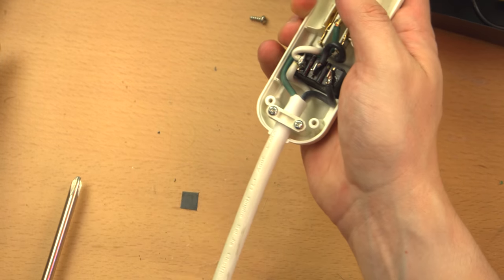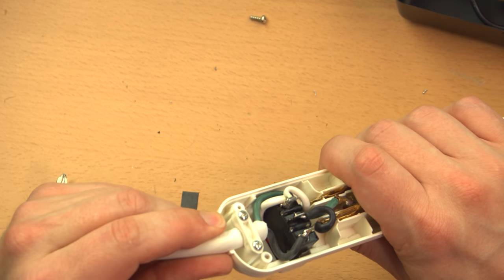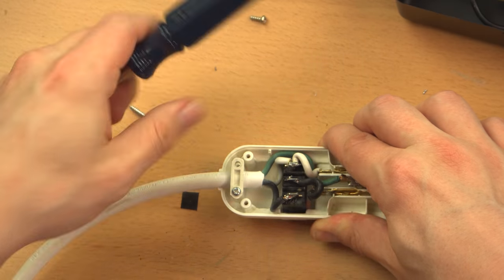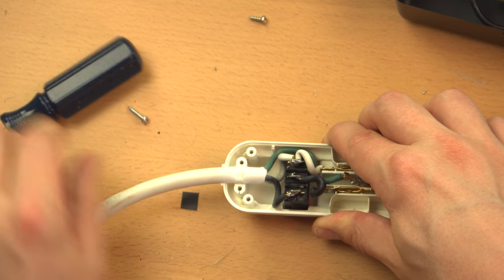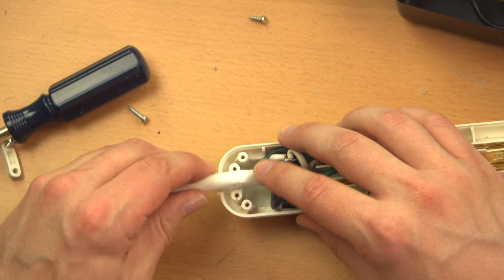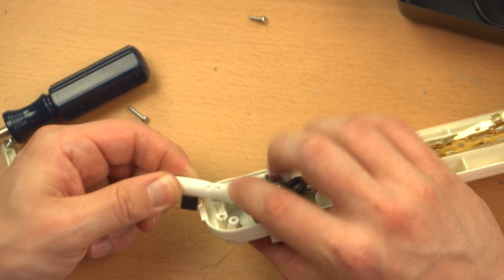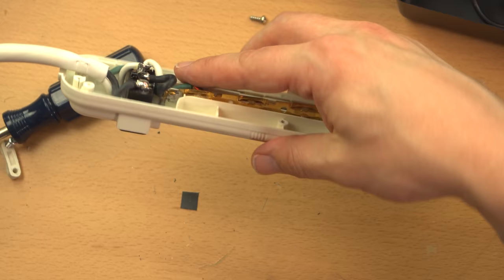I didn't address that on this power strip, but this one you can see is a bit chintzier. It's got these two screws holding down the cable with decent compression, but I'm betting that if I take this off, we're not quite going to see as much impinging on the cable and as much surface area contact. It's certainly not as wide as the contact in the Belkin. You see it's hitting three spots. It's got three little indents, but they're a lot closer together than the Belkin, and on the bottom, there's really not much in the way of friction there. It's fairly smooth. It's got a couple little indents there, but overall, it looks like the Belkin would hold its cable a lot better than this cheap non-branded one.